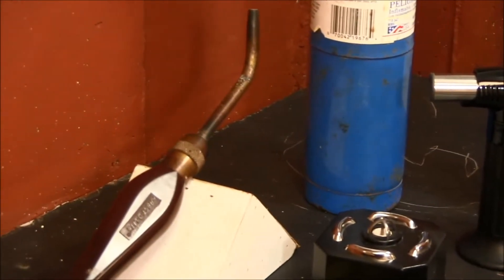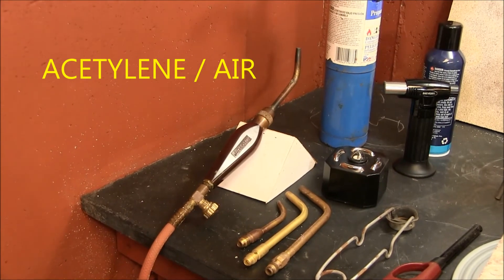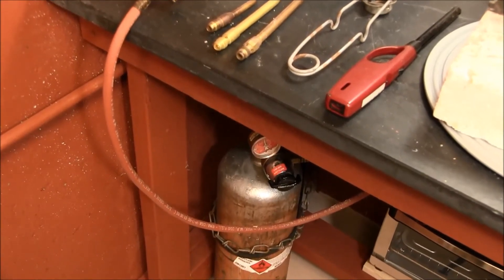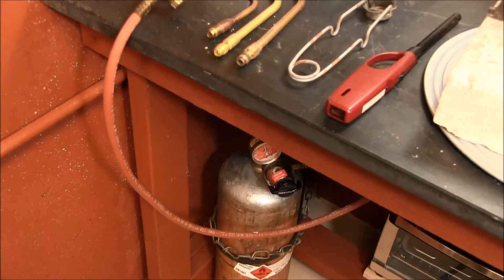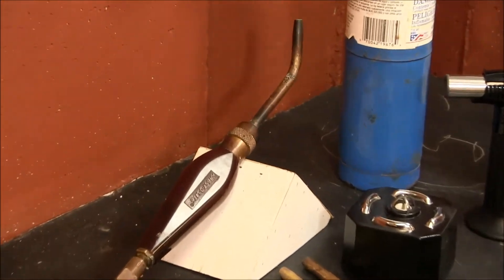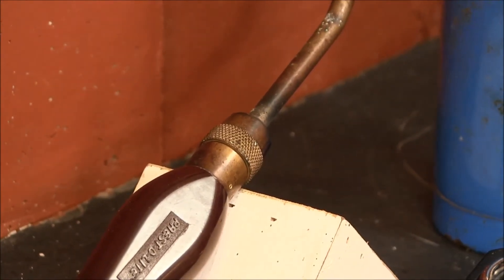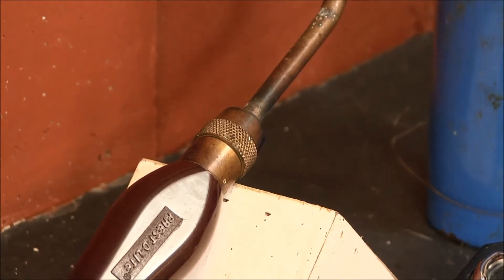This type of torch right here is an acetylene torch and it does not have a self-starter on it. You'll notice that there's a hose attached to it. That hose goes down to the tank underneath my bench — this is an acetylene tank. There is no oxygen or air in the tank; it's only acetylene. It has a gauge on the top that goes into the torch hose and then up to the torch itself. The air is actually mixed in right here at the end of the torch underneath that little clamp, where there are little holes that introduce the air into the gas so it'll burn nice and hot.